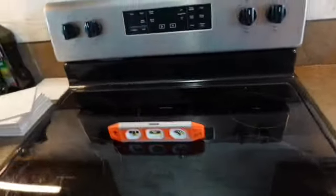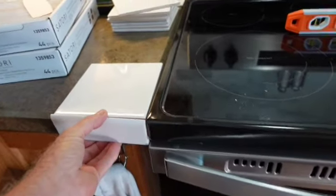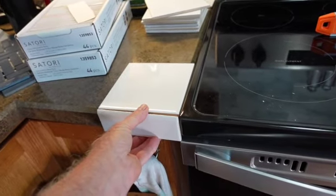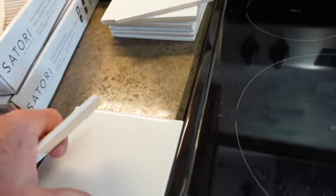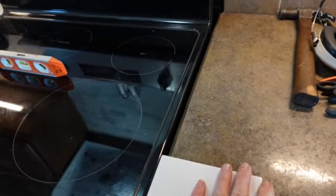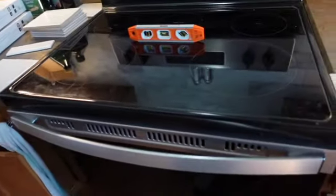I'm a little bit out but it's okay. She probably won't move because I've got her fixed down. What I'm gonna do here — it's going to look like this. I've got to chalk off this little corner so the door will open — you've got to keep everything as aligned as possible. I want to bring the tile all the way to the edge. In tiling you end up picking your battles. I've got the height right and she's level and fastened down pretty good.